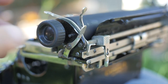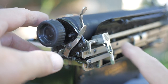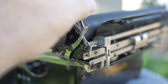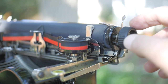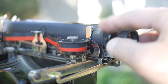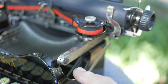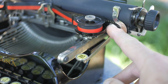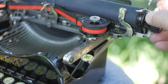Now for the right side of the carriage. This lever right here is the margin release lever — you can see it pivoting the margin bar. This lever is the right-hand carriage release lever. And this is the lever that releases the pressure rollers to enable you to feed the paper into the machine. The backspace lever is on the right here, and it is rather convenient, although it is not on the keyboard itself. And this is the right-hand paper finger, which rides along the paper scale, which goes up to 84 on this machine — it's a PICA typeface.